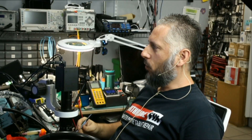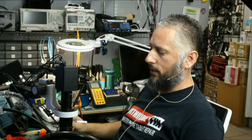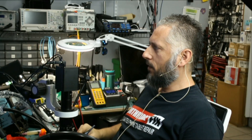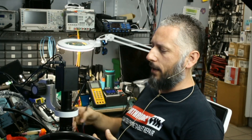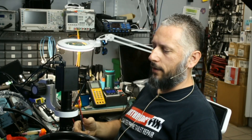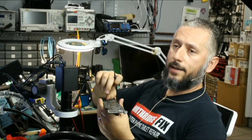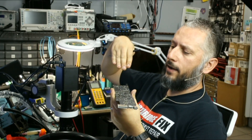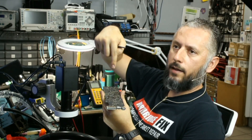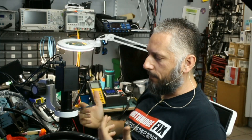The question you may ask: what's the use of having a ring light if you have this anti-glare light? You do have a lot of uses for the ring light. Sometimes you see things with the ring light that you cannot see with the external light — maybe you are trying to read the writing on a chip, and sometimes you can read it better using a ring light. I find myself switching between the external light and the ring light. You need to have both because you have full control of how you want light to appear on your board. For example, if you have a large capacitor that blocks the angled light, you end up using the ring light to shine light directly on the board.